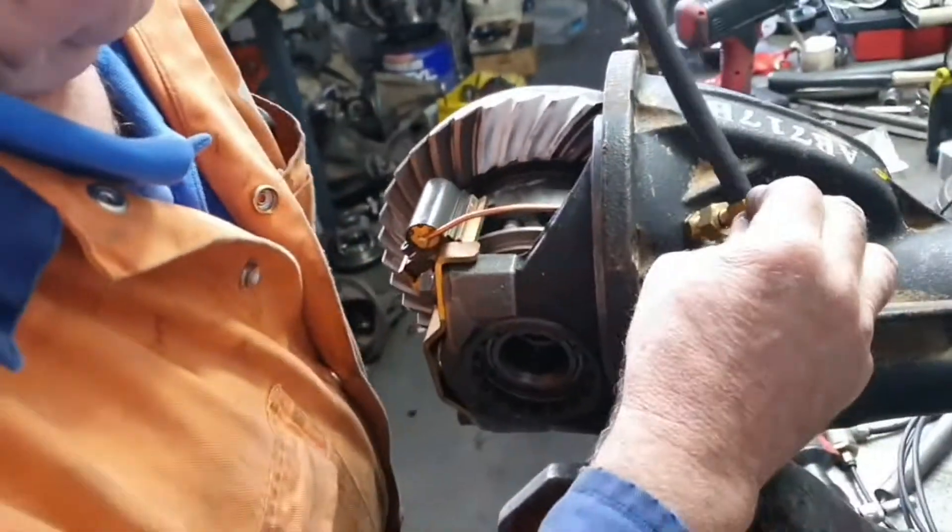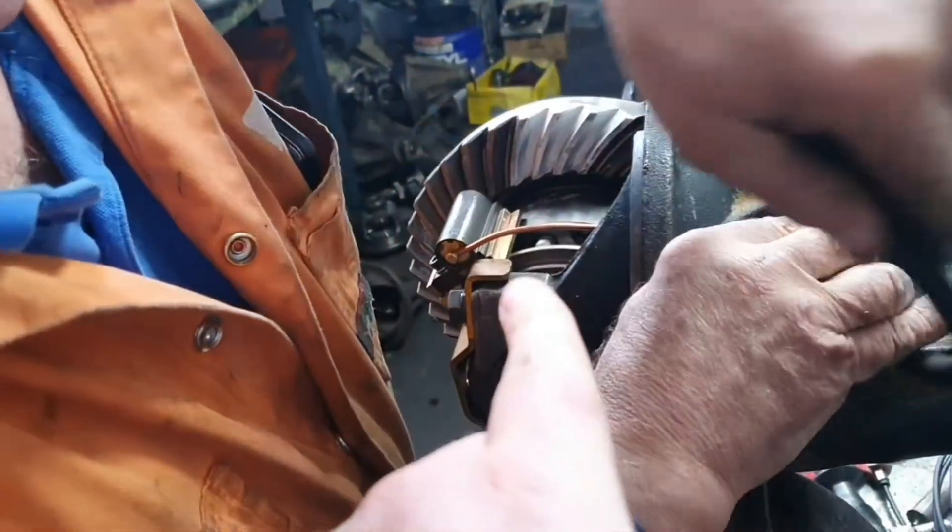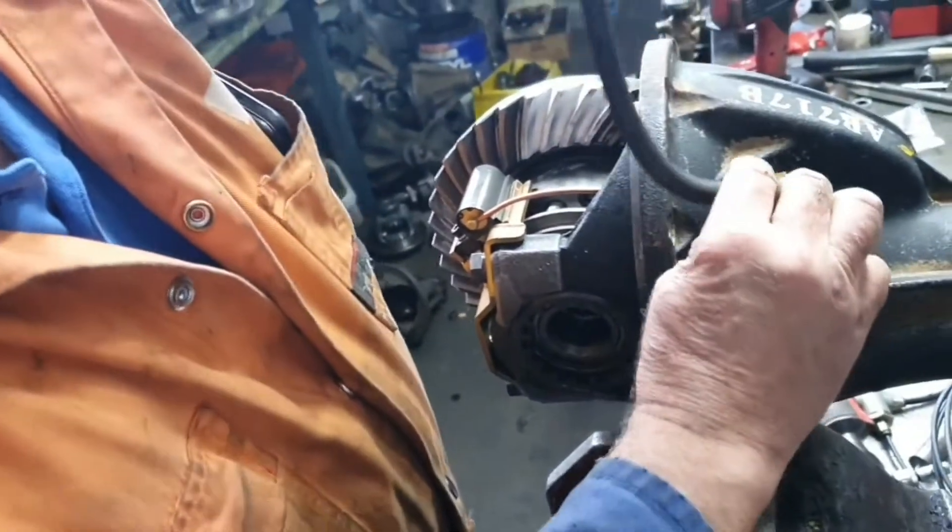There's no clearance like that. I think we've put five rings down here. You've got to put a one mil washer inside that pneumatic cylinder to stop it stroking so much, because I made it wrong.